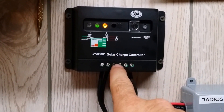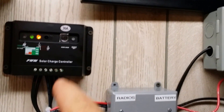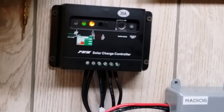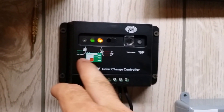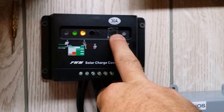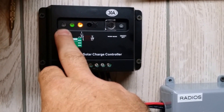Panels come in through here, go to the charging circuit, and come out to the batteries on these terminal models. Panels come down through here into the charge controller; charge controller goes out to the batteries. These right here are my load. In my load I'm running 10 LED lights upstairs throughout the house — we'll go up in a few minutes and show those. This panel will sense the solar coming in. When the controller senses there's no more solar coming in, it will automatically switch the load on. You can set it to stay on for an hour, two hours, three hours — I have it staying on until it senses light again, and then it will shut the load off.